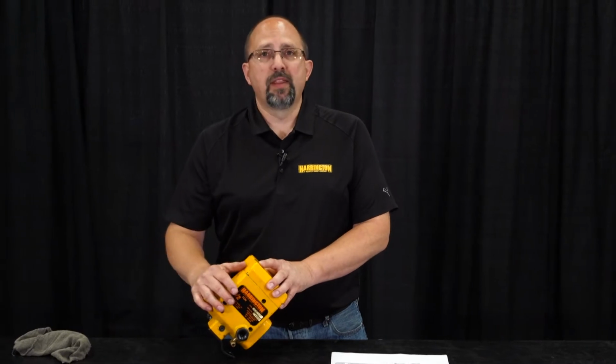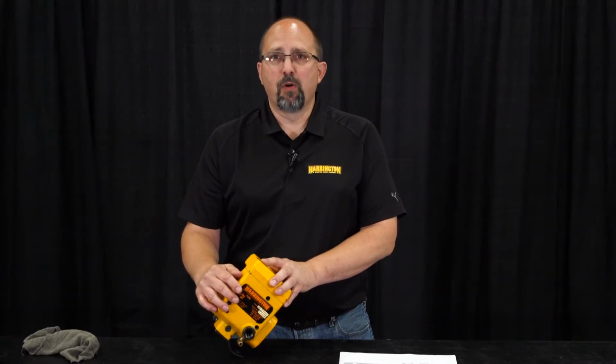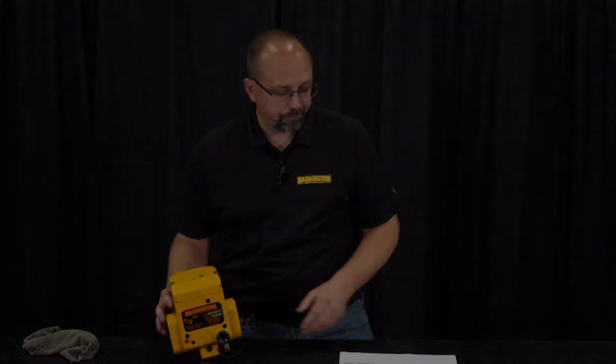Many times, either of those concerns are in the valve body, and we can take care of that with an overhaul. Today we'll talk about how the valve body works, how we take it apart, how we properly put new O-rings on, how we put it all back together, and make sure that everything works again.